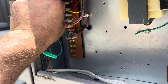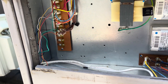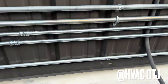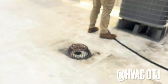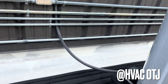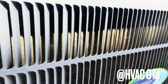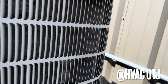I like to take the R wire off first, then the other one — if R touches something you're done. Nick is cleaning the coils right now because these things are in bad shape. That one's not bad but look at this — these are plugged to the nines with cottonwood. Dirty coils will cause compressor damage too — keep your coils clean.